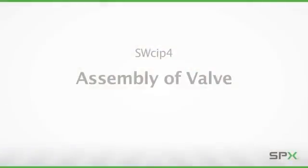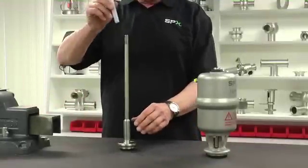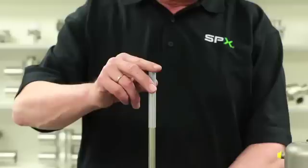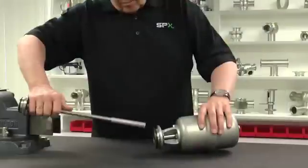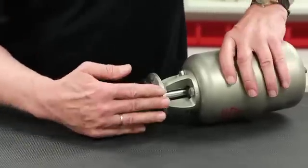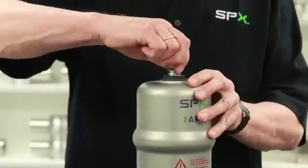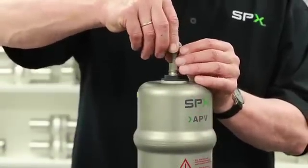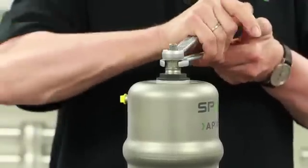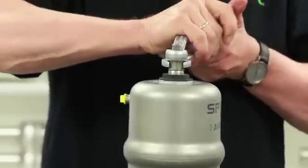The next step will demonstrate reassembly of the valve. Place the plastic tube, which also comes standard with the APV replacement seal kit, over the thread at the top of the guide rod to prevent potential damage of the shaft seal inside the yoke when inserting it through the yoke. Push the valve shaft through the shaft seal. Position the valve upright and install the centering ring. Next, install the self-locking coupling nut and tighten using a 19mm wrench. Use a 17mm wrench on the centering ring to block it in place.